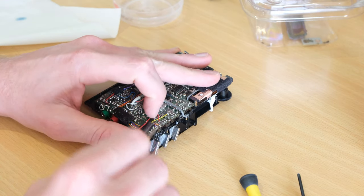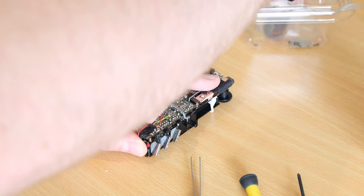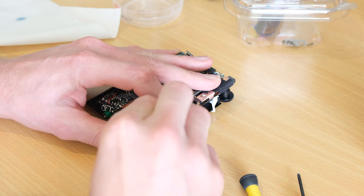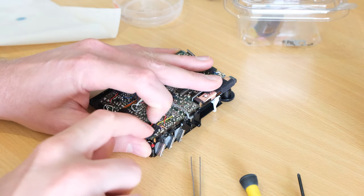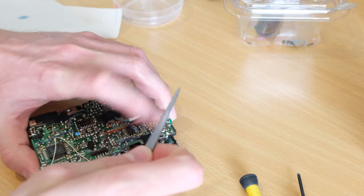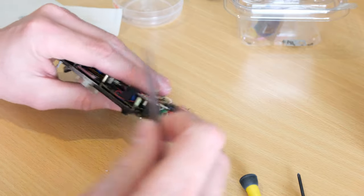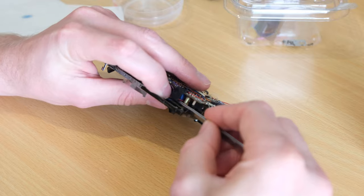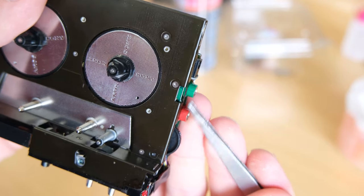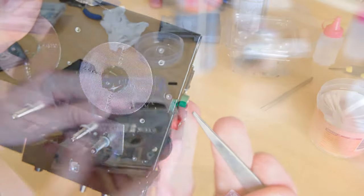My least favorite part is dealing with the LED wires — if they haven't broken off already they will probably break off here. About 80% of the time I pull these things apart those always break — the ones at the back near the battery compartment as well. It's good to take some photos before you start so you know where the wires are. I've linked the service manual for both the F15 and F65 in the description because they are very similar. A very common issue on these is for the plastics to crack and shrink around the headphone and microphone ports, which will pull out the metal spacers.